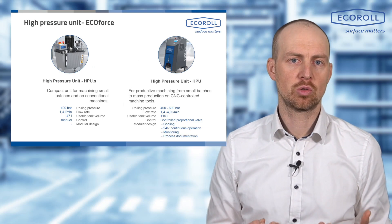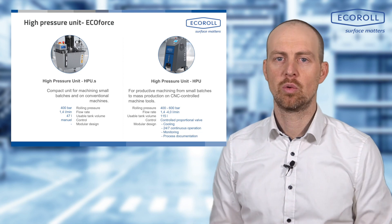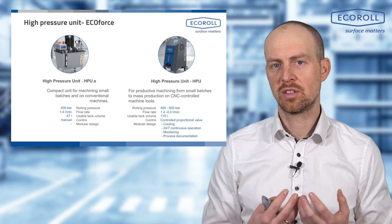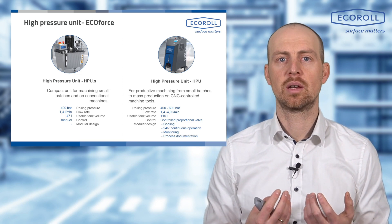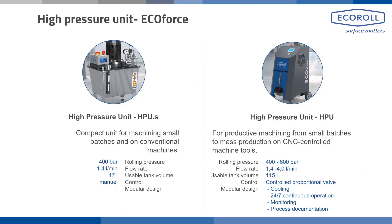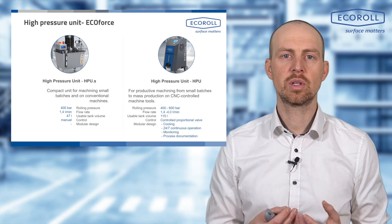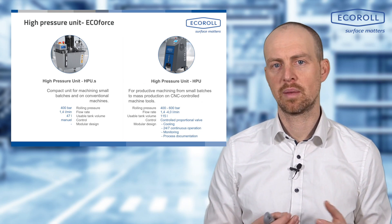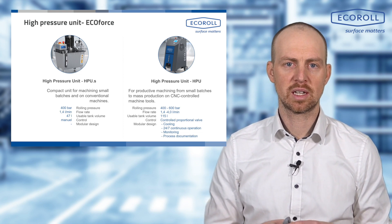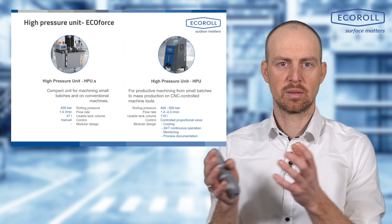To effectively utilize hydrostatic smooth rolling technology, you need not only a tool but also a high pressure unit. This high pressure unit must generate very high pressure — 400 or even 600 bar — to achieve the corresponding consolidation. The hydraulic unit must meet certain requirements, because any jamming of chips or dirt in the ball holder immediately causes the ball to stop, resulting in a rubbing process instead of a rolling process. For this reason, we offer the advanced EcoForce technology. Our hydraulic units of the HPU type are specifically designed to work with hydrostatic tools as an integrated unit of technology, tool, and aggregate.